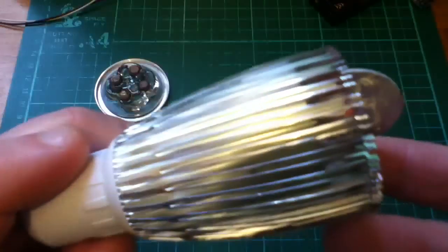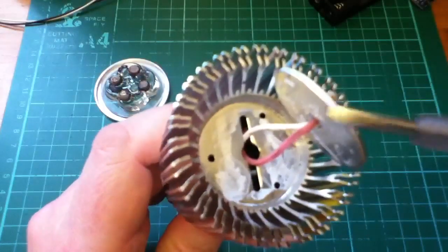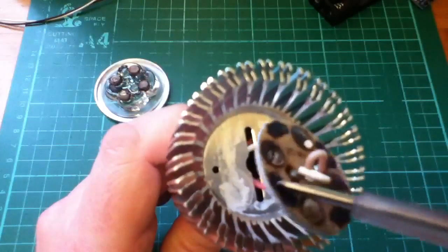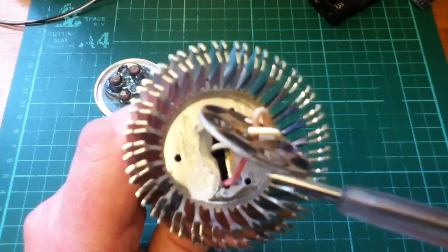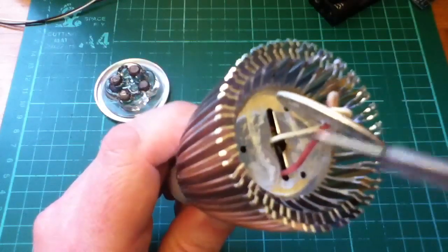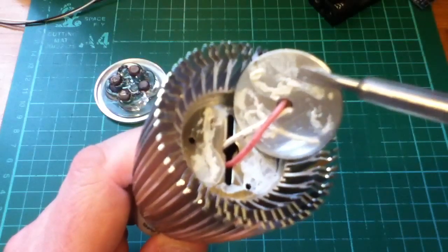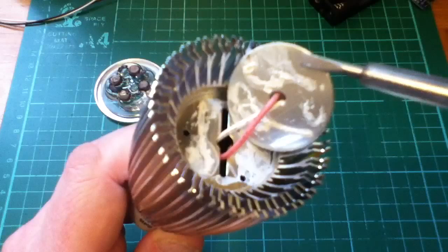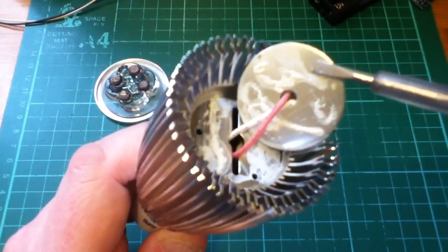It's a very big heat sink on this one, so it should be perfectly capable of dissipating the heat. There's a lot of power there — there are four 3-watt LEDs, hence the 12 watts. But I think that was just bad assembly. Nothing inherently wrong with the design, probably. I mean, it probably does get hot and stay hot, but you can see that's just not been put together properly, and that's why it's failed.